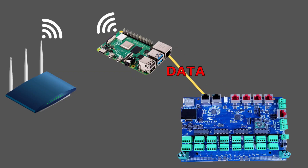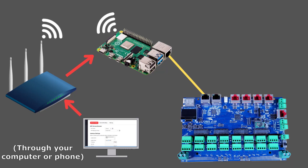With this setup, whenever it's time for your Lightshow to start, your Raspberry Pi has a direct connection with your Pixel controller and can send all the data over without clogging anything else. Even though the Raspberry Pi is connected via Wi-Fi to your home network, it doesn't need to send the pixel data that way — all of it goes through the Ethernet port into the Pixel controller. We still use the Wi-Fi interface to connect to the router so we can access the control menu and change settings. Since the controller is hardwired to the Raspberry Pi, which is on the router via Wi-Fi, we can technically also access the Pixel controller with a little extra configuration.